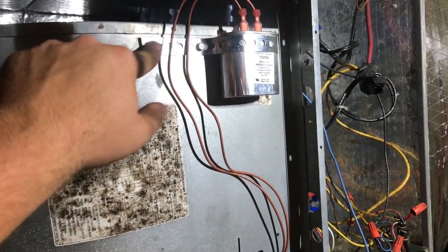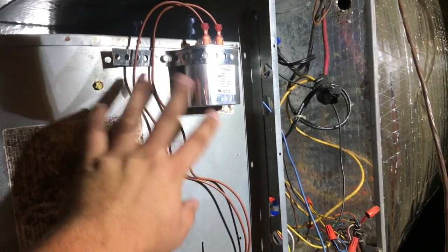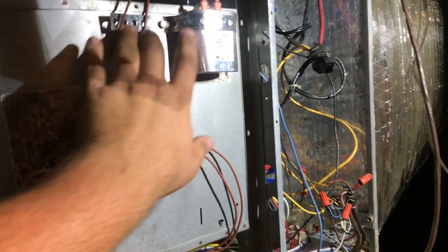When I hang the capacitor up with plumbing strap, I always leave it a little bit long. That way, if somebody ever has to change this capacitor and it's a different shape, you've got some room where you don't have to use a new strap — you can just adjust this.